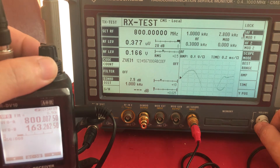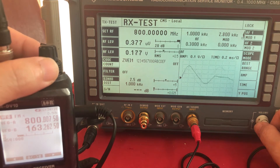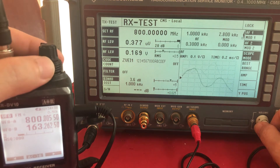So in the region of 7.5 to 8.5 kilohertz of frequency error — that's more than a narrow band digital channel space at 6.25 kilohertz. It's crazy off. Absolutely useless.